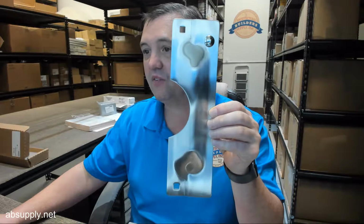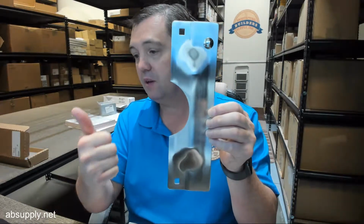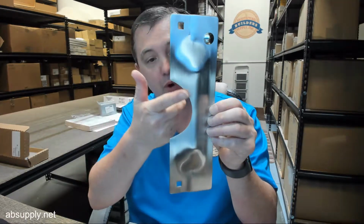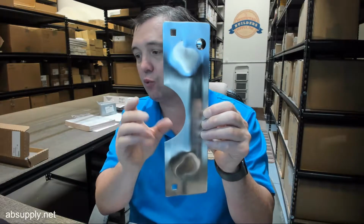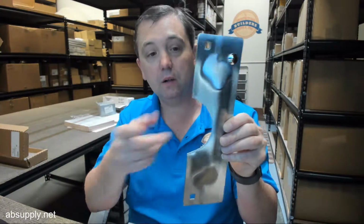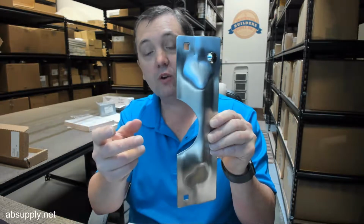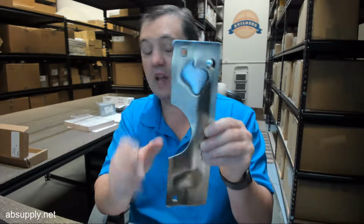The CXL is a specific variant, and that variant is detailed down below, but in short, what makes it different from its 320C, its 320CL, and the 320CXL, in addition to the base 320, is that the preparation in here for the rosette is for 2 1/4 to 3 3/4 diameter roses on cylindrical locks, meaning the size of the prep here is the XL. If you had the L rather than the XL, you'd have a preparation for 2 1/4 to 3 1/4 size roses. If you had just the 320C base, it would be 2 1/8 inch or less. So how do you know which one to use? Well, just measure the diameter of the rose of your cylindrical lock and choose accordingly.